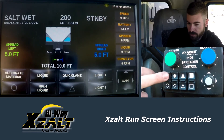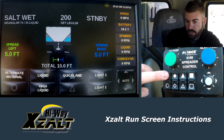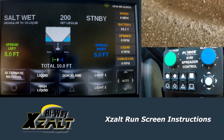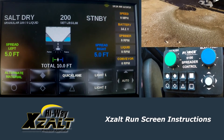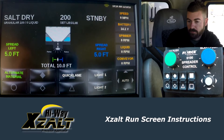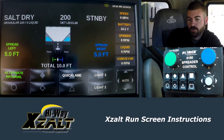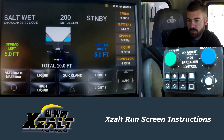We'll talk about alternate material first. Alternate material allows us to have two materials saved on the fly — basically a primary and a secondary. Our primary one is this salt wet 70-30 material. Our alternate material is salt dry only. In some instances, you may run out of liquid first. If you do and you've got just a little bit of salt left in the box, all you do is hit your alternate material, it'll switch over to salt dry, which is 100% salt only. Then you set your rates just like before. Once you get back to the salt barn, fill back up, put your brine back in, deactivate your alternate material, and it goes right back to your 70-30.